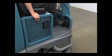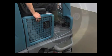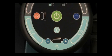To stop the machine, release the propel pedal and press the brake pedal. As the machine stops, the scrubbing systems will stop. They will begin again when you resume propelling. To stop scrubbing, press the one-step scrub button. The light next to the one-step scrub button will go off and all scrubbing functions will stop after a short delay.